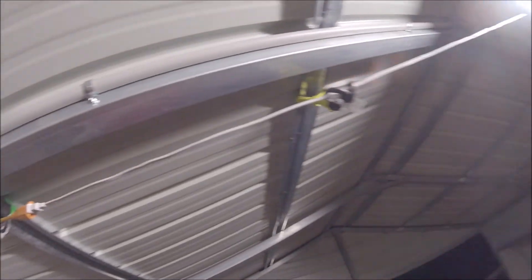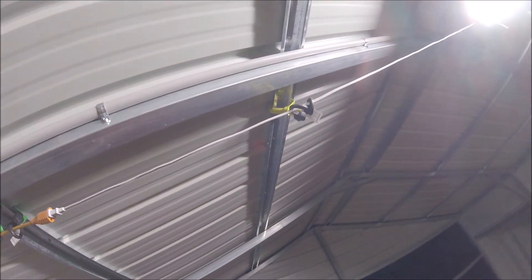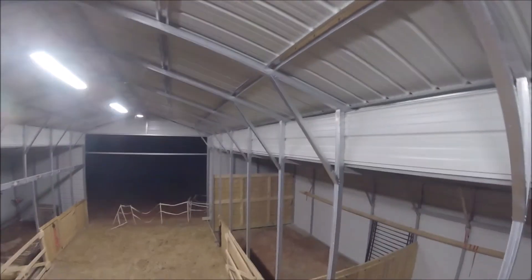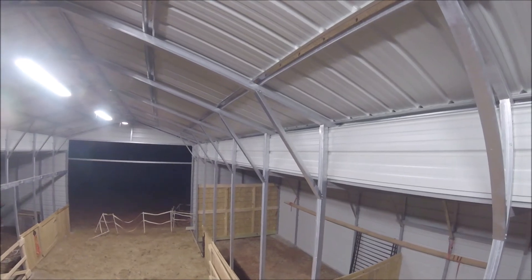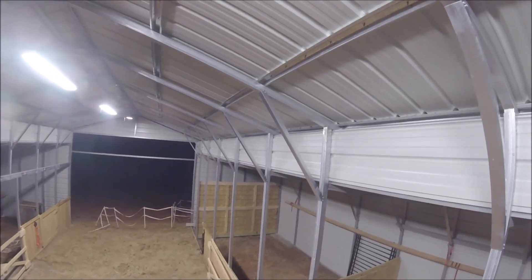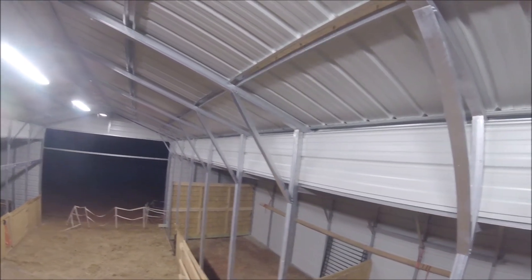What we're going to do is up here in the junction box, put in a 120-volt GFI. This little white cable will go away and get zip-tied up nice and pretty — it'll get its power from that box. This conduit I ran down will do a 90 and get its power from way over yonder in that last room. That's going to be the electrical room — that's where the batteries, solar panels, inverters, and everything I picked up for this place will be. It'll all be wired up through here and nice and tidy.